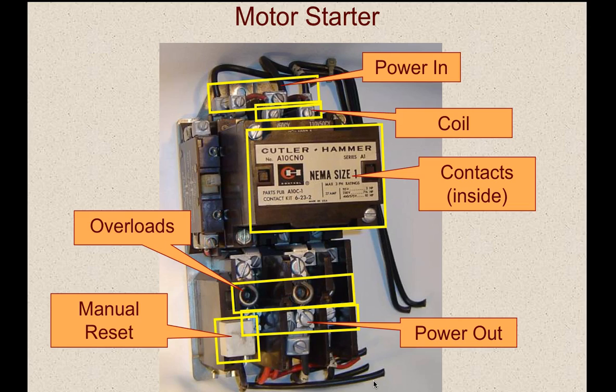If there's a voltage imbalance, which causes current imbalance, it's going to cause it to trip. This is just an indication that there's a problem. Usually the motor starter being tripped is not the problem with the starter itself — it indicates a problem somewhere else in the system.